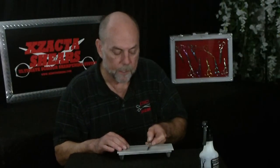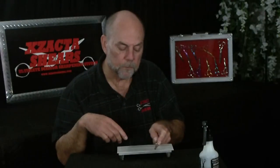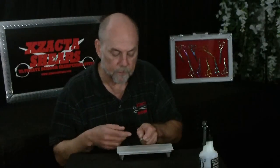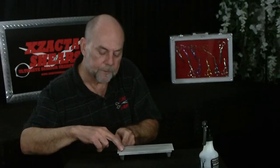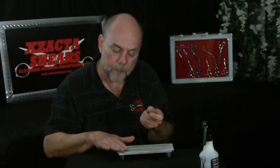Any contact with the hands is on the back of the blade — no pressure toward the cutting edge. When engaging the pad, lay the back of the blade down and let it roll very gently into the pad. Apply very gentle contact toward the back of the blade with two fingers. When disengaging, take those fingers off, roll the blade up, and take it off. Never move the cutting edge into the pad — always away from the cutting edge.